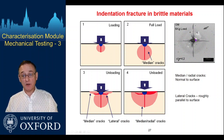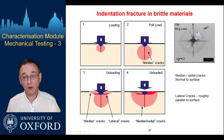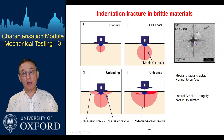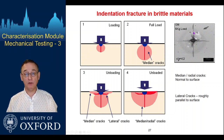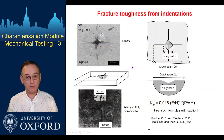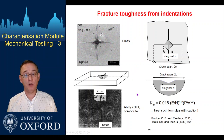Those tensile stresses are rather larger near the indent and fall away as you go further out. What tends to happen is that the crack can nucleate and grow where it's above K1C, close to the indent where the stresses are large, and it will run out until the stress intensity at the crack tip is small enough that it won't run any further. So we can use this to measure the fracture toughness of our material.